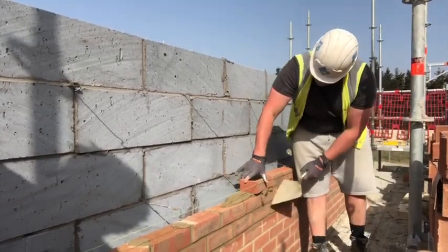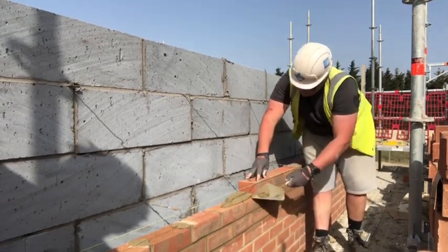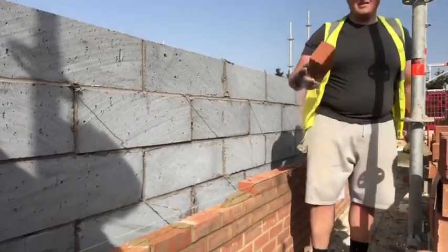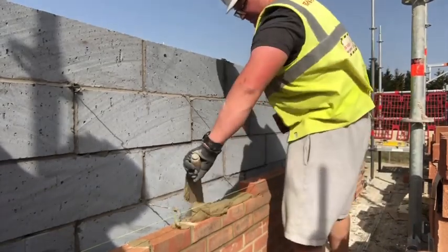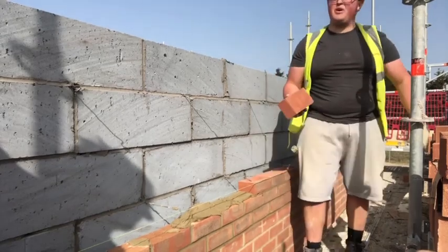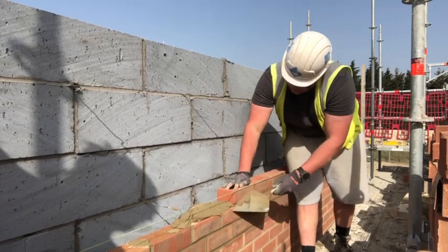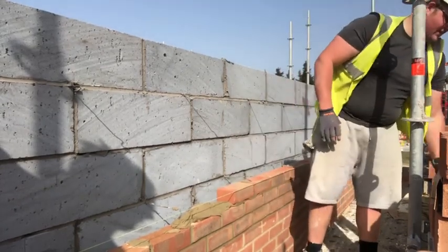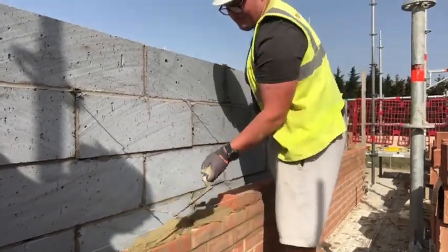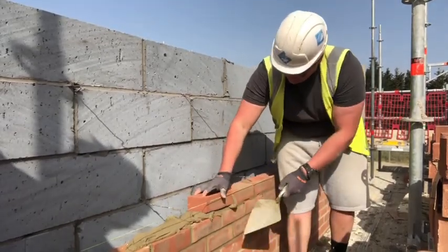I'm going to convert soon to using a big long six-foot Draper level as a profile instead of aluminium box sections — just put some gauge tape up one side and away we go. I can't emphasise enough how much time gauge tape speeds you up over a day. You don't have to rely on using your tape measure every time you move the line up. Gauge tape gives you a consistent gauge all the way up, and you just measure off your formers.